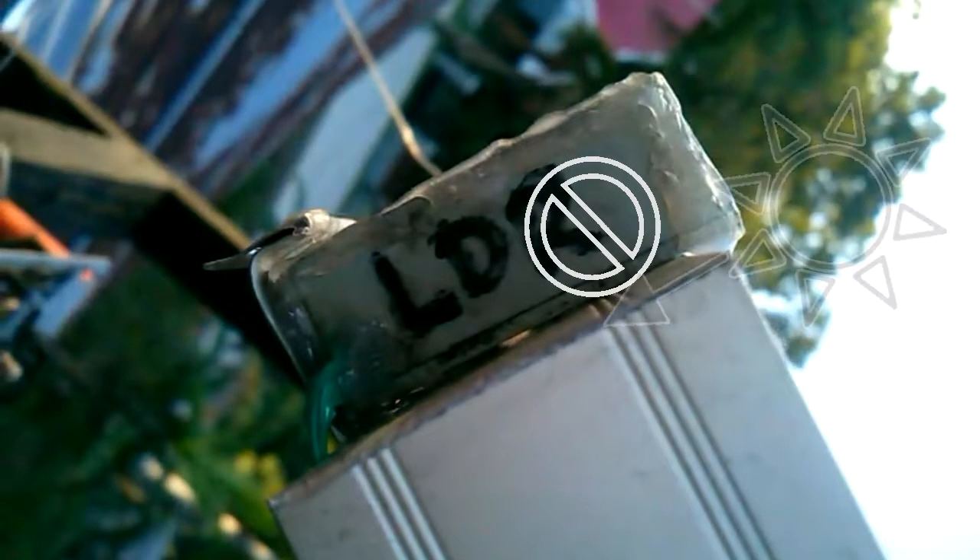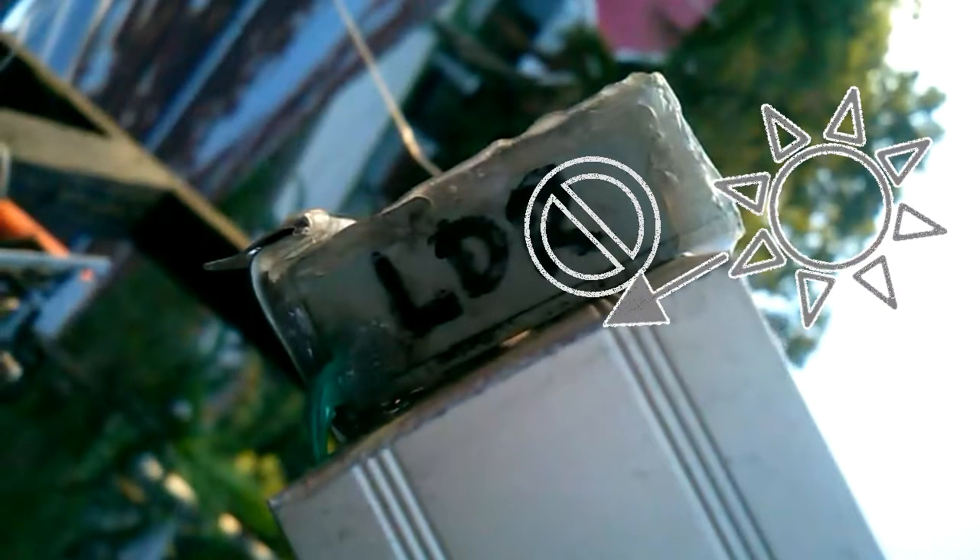This is the motor controller circuit that has two ICs. This one controls the motor, and this one is the dual op-amp IC — it amplifies the signal coming from the two LDRs, or light dependent resistors. I put the two LDRs in a water-resistant plastic enclosure and perpendicularly mounted it on the frame. This enclosure also shades the LDR when aligned 90 degrees with the sun.